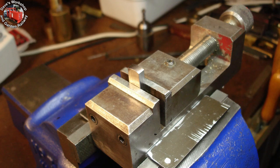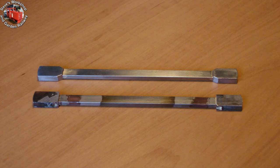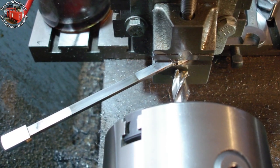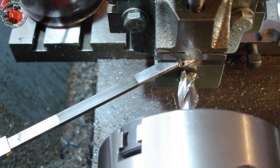The boss radius has been filed smooth. The coupling rod straight after silver brazing. The lower rod has been pickled in citric acid to the level of the second clear patch, each end one at a time. Milling the angled blend-in — the rod was set using a protractor set to 60 degrees against the chuck diameter.